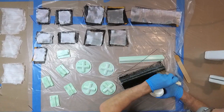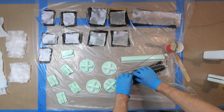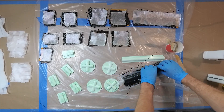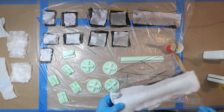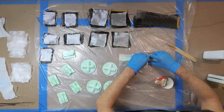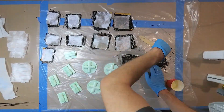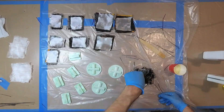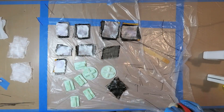After the final layer of carbon fiber, I put a peel ply to create a nice-looking finish surface. The peel ply doesn't stick to epoxy and is removed when the part is taken out of the mold. A final layer of breather cloth allows air and excessive epoxy to pump out of the area around the part during vacuum bagging. I don't have footage of vacuum bagging, but it is really simple — I just use typical storage vacuum bags with a hand pump. I leave parts in the vacuum bag for at least 8 hours.